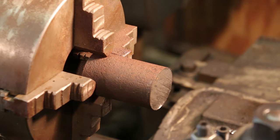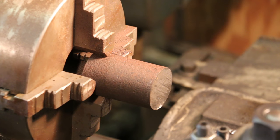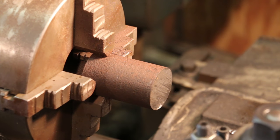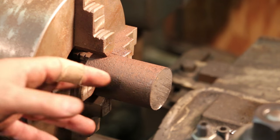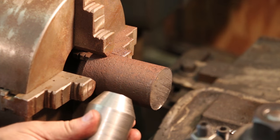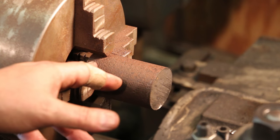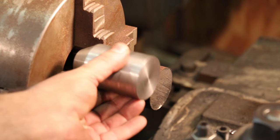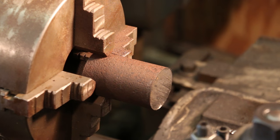I'm working with two-inch material. This is old rusty stock — it's got some pitting and stuff in it. I'm not worried about the outside diameter, but I do want to clean these up. I'd really like to get it all in one chucking and not have to flip it around, but because I'm putting that taper on one side — about three-quarters of an inch — I'm just gripping it and letting it stick out. This will become the side that's tapered in the next step when I flip it around.